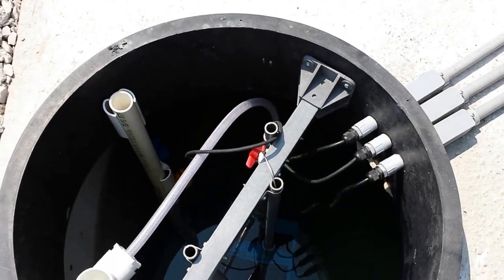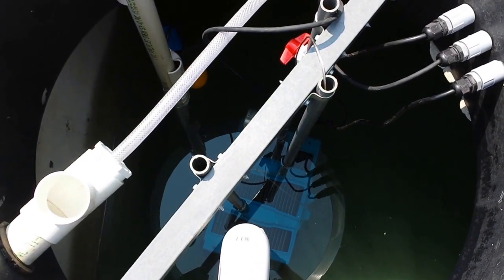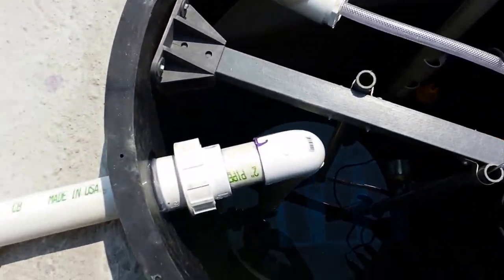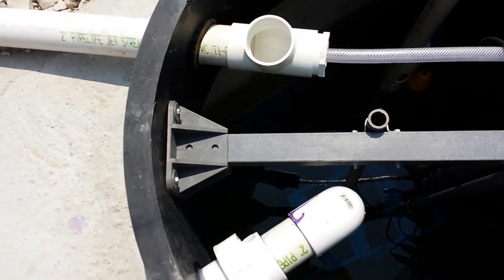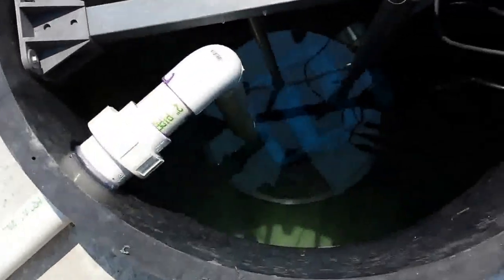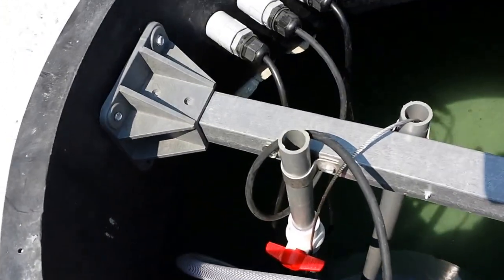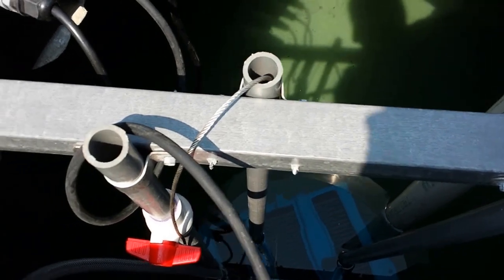The wire size for the floats and for the BioBarrier pump is 16 TFFN or THHN stranded wire. The wire for the blower in this case is number 14 THHN or TFFN. In order to be able to pull this out, we have the Biomicrobics Containment System, which is a unistrut cutout, and we have the union for the air in a horizontal position, not vertical. The pump and the clean-in-place line have to be kept solid so it doesn't move around, and so we attach it to the same bar as the hold-down pipes.